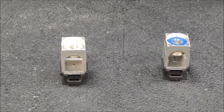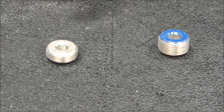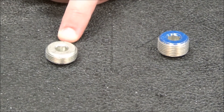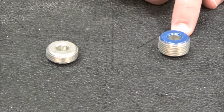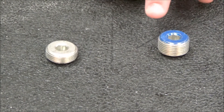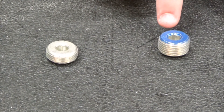The difference is in the wire binding screw. As you can see, the wire binding screw for the AL250JD is a shorter wire binding screw, allowing for larger wire to fit in than the AL175JD. This is also denoted by the head of the AL175JD wire binding screw being painted blue.